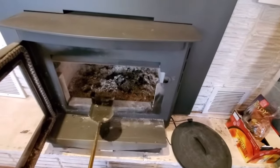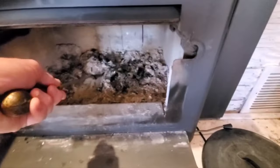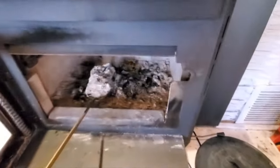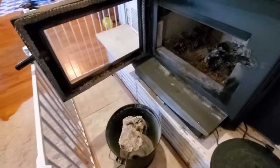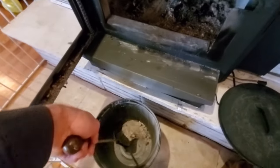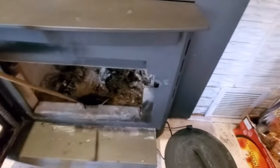These wood stoves don't need a real long tool — a simple short shovel is just perfect for wood burning inserts. When shoveling the ash, you're going to reach inside, scoop it up, push it against the back wall, get a big shovel full. If you have a second hand free, bring it down close and tilt your ash bucket up to match the angle of your shovel so you don't get a big plume of white ash.